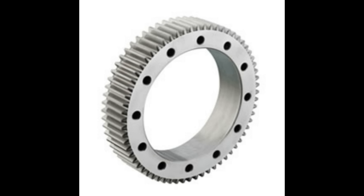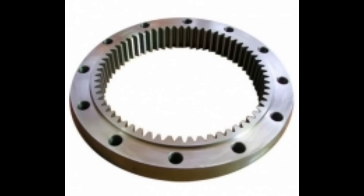Helical gears require pretty precise alignment, are expensive to make, and can be prone to wear if not aligned properly. Double helix gears cancel out one of the major issues with helical gears - because helical gears are angled, they produce thrust and are mostly used with thrust bearings along the axle. Herringbone gears balance out this thrust, are smooth and quiet in operation, but are devilishly complex and stupidly expensive to make. However, in 3D printing that isn't an issue - it costs the same to print a spur gear as it does to print a double helical gear.